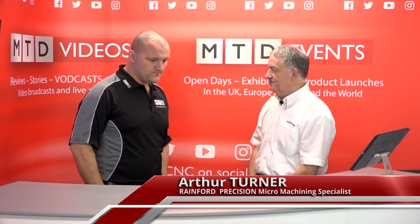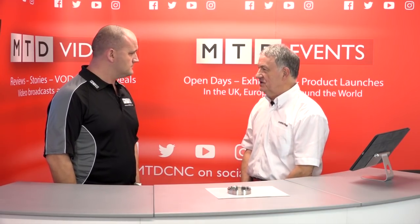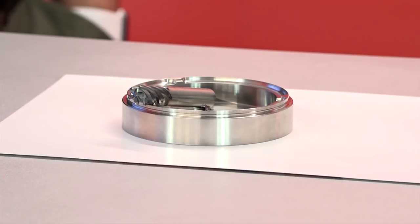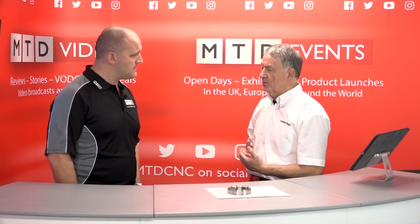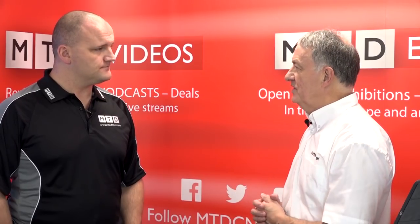Both drills and end mills. Can we talk about the end mill first? One of our new products is our CXRS, which like a lot of companies is a five fluter, but with variable helix, variable pitch, quite an aggressive helix. The interesting thing is we're starting at three millimetre diameter where a number of companies are starting much bigger for the larger volume components. For us, three millimetres is quite a good starting point because we're into the smaller product ranges.